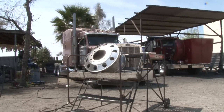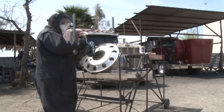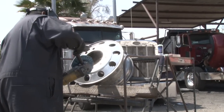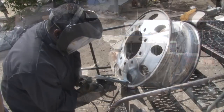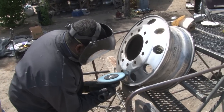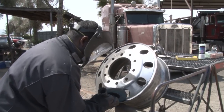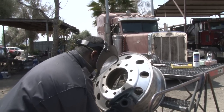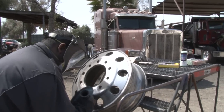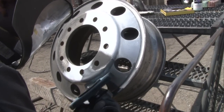Alright, now we're going to start the machine polishing process — start with heavy cutting. He's got a Zephyr Blue Baron wheel on there and the 87 Stainless Bar Rouge — that's going to be for your heavy cut. Anytime you have to sand a wheel or any aluminum, it's best to start with a heavy cutting wheel and a very heavy cutting rouge like Zephyr's 87 Stainless Bar Rouge. It's got a 320 grit emery in it and it's going to help you get the job done a little bit quicker.